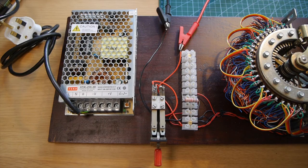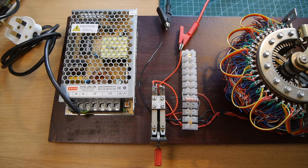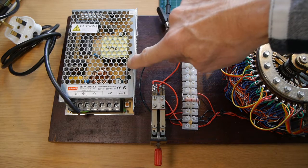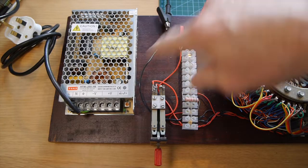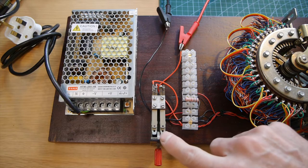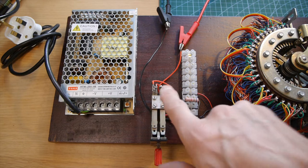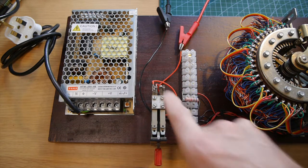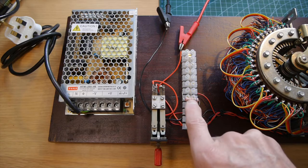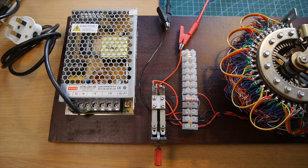So as far as power goes, it's fairly simple. The uniselectors all work off about 50 volts, and so I've made the whole thing run off one power supply at 50 volts. I fitted a little mains power supply here, but I haven't actually wired that up yet — I've been running off the bench power supply. And I've got an old GPO switch here, which I thought was rather nice. And then the voltage — 50 volts — goes to the uniselectors, and there's a resistor here to drop the voltage to about five volts, so the LEDs get about five volts each.